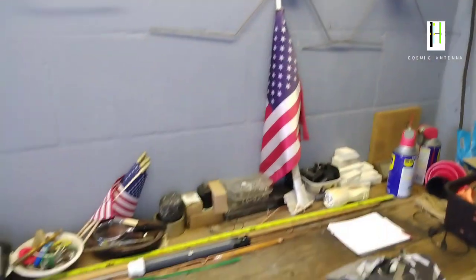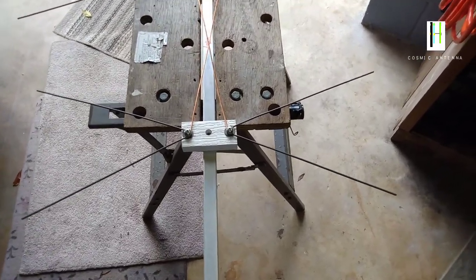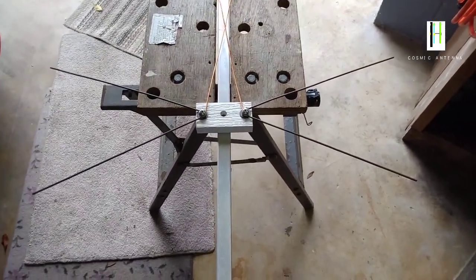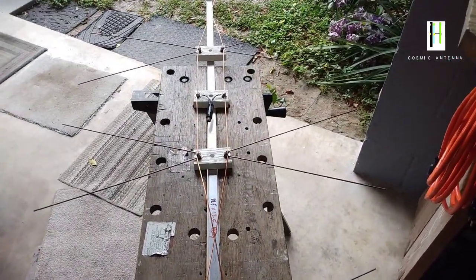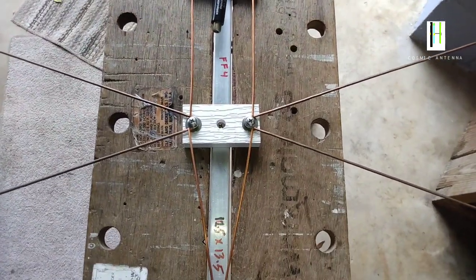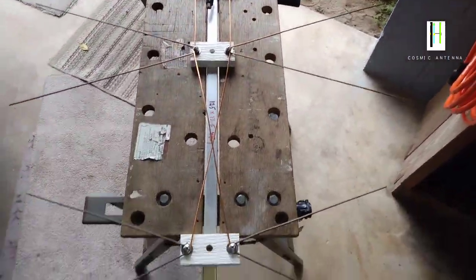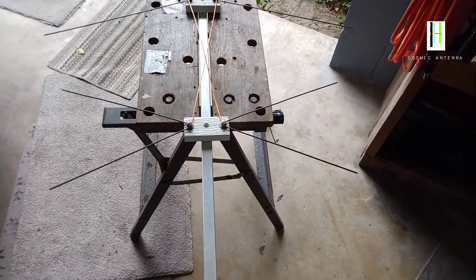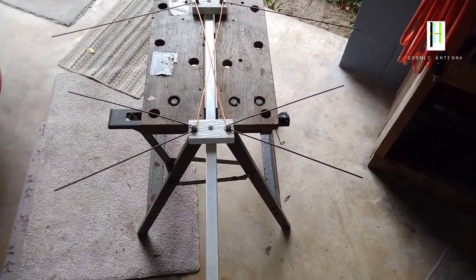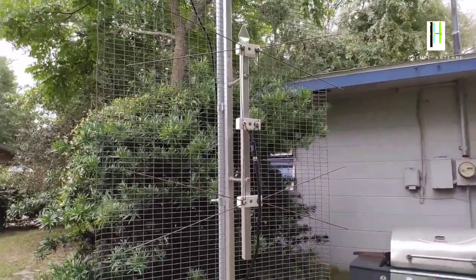The 12x16 is a great all-around antenna. If you have channels in the upper frequencies above 31 or 32, those smaller bows will do the job of picking them up. They are great antennas — this really picks up well. It has to do with these four 12-inch bows, because like I said, I'm not receiving anything that the nine-and-a-half-inch bows cover anymore. They may pick up some of the lower frequencies, but they really aren't doing the job like they used to. Just thought I would mention this.